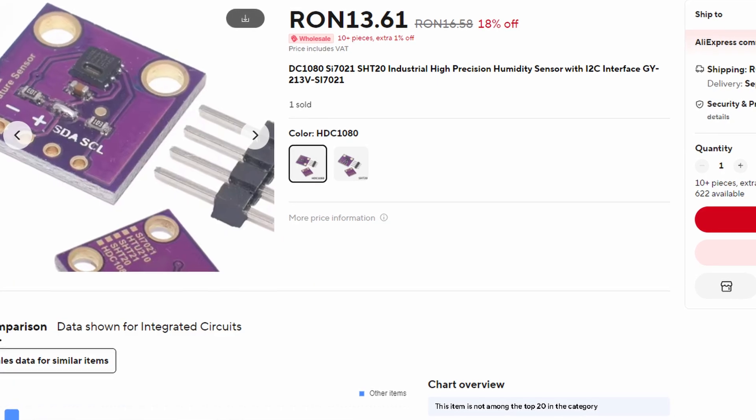This is not the final version — this is like a Beta 2 test of the prototype that I'm planning to run this winter to see what modifications and improvements I can bring to the board and enclosure. In terms of components, the relay is triggered by an ESP01S board, and the main control unit has an ESP8266 with a temperature sensor, an OLED display, and a rotary encoder. All the parts and the ESPHome code will be linked in the description.